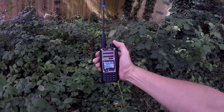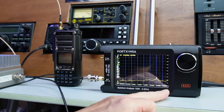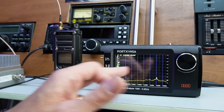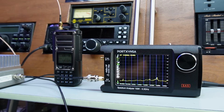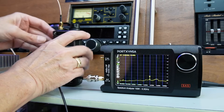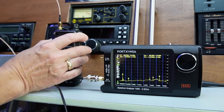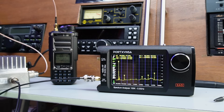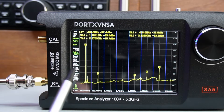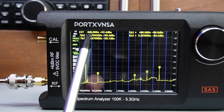Next we need to check its harmonics — time for a harmonics test on 446. I've set the scope going right up to almost 4 GHz, so we'll see a much wider spread, but it will take a bit longer to get a reading because the scan rate is going to be very slow. I have to key the radio up and then come back to it. Keying up 446. There they come. Let's zoom into the screen and see how we got on — it doesn't look too bad, to be honest. The fundamental signal shows we were keying up on 446.156 and the scope reads 446.0 — slightly out on the frequency.